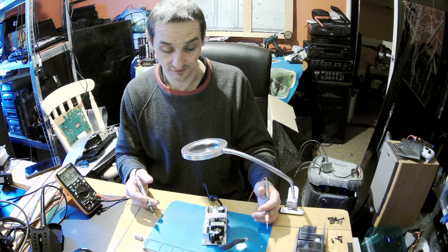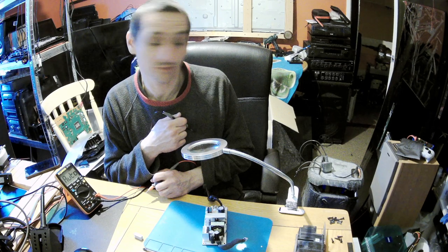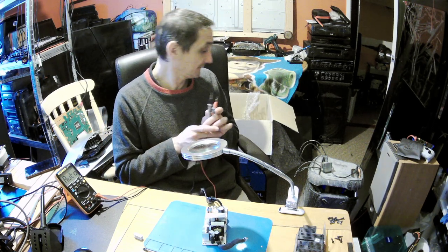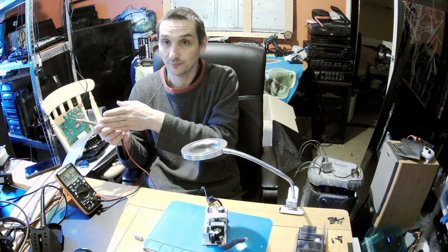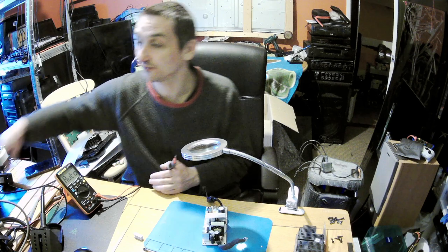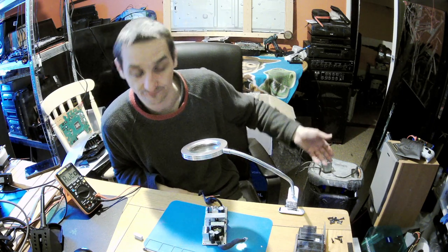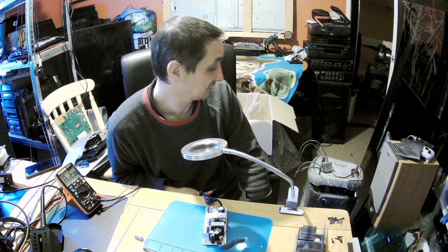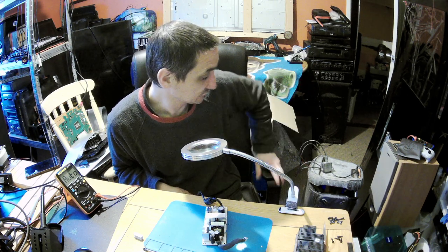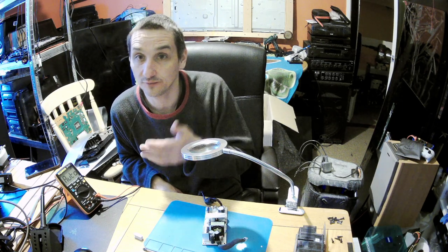So we don't know that. We can assume the input on the main board. The problem is that I did have this and I don't remember. Maybe I've got a video. Maybe that video is showing me what DC voltage I need. But I know as a fact that I could plug in my power supply, because there is only one voltage plus and voltage minus, which I could figure out, because I would see how much this one consumes as a maximum power consumption. And then I can use something which will have higher power, like twice more than that. And that would allow me to have this buffer, yes? So then I can reuse it. But unfortunately I don't know the parameters, so I need to plug it in, see how many volts, how many amps it will take.